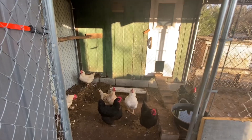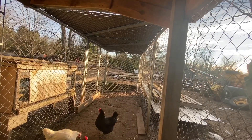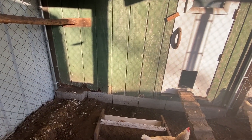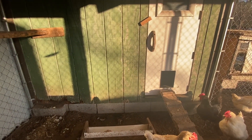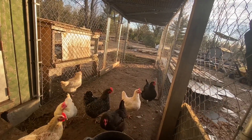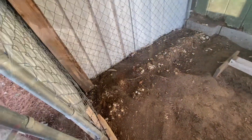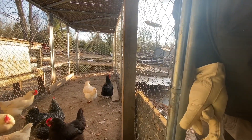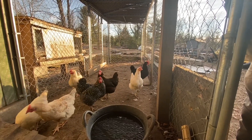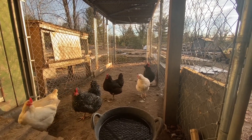These panels I picked up at a yard sale — they're six feet by six feet and there were eight of them. I got them pretty cheap, a hundred bucks for all of them. I set the shed on cement blocks; I didn't put a foundation, just leveled the blocks and set the shed on them. Then I set up all these panels and poured concrete around the bottom of them, coming out about eight inches into the pen and a couple inches thick. That prevents the chickens from trying to dig out and anything else from trying to dig in.